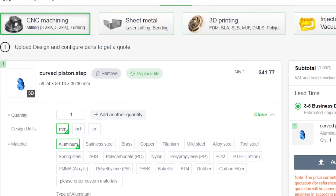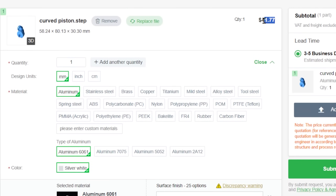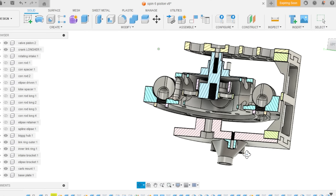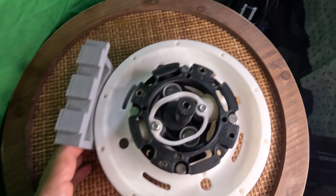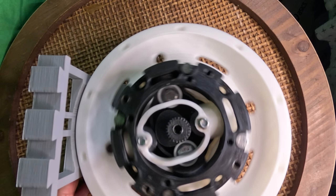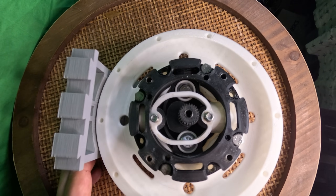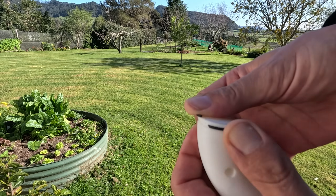I put my piston design into the PCBWay website just to get an idea of how much it will cost — $41.77 US, reasonably good. I need four of those pistons, but I need to keep working on the design and get them perfect to what I want. I've got a lot more design work to go through — I've got to put ball bearings in everything that needs them. This motor's going to end up being 178cc, 9 to 1 compression ratio. I'll probably just make the first housing out of mild steel, which is reasonably cheap. I'm not going to worry about an oiling system or cooling — I just want to make sure something runs before I get too carried away. These internal pistons are the same diameter as the rotary pistons, so I can use the same rings which I've bought, which are an off-the-shelf item and pretty cheap.